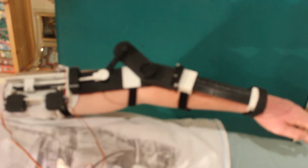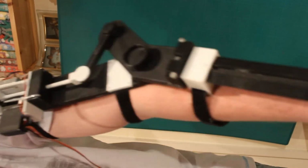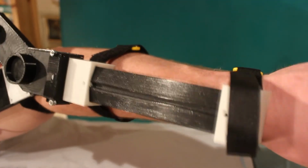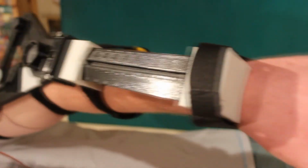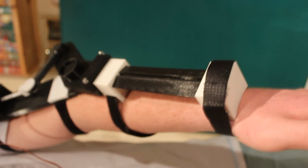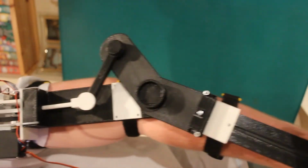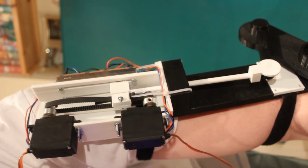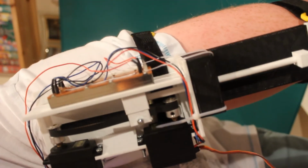I'd also like to point out the entire thing is made from 3D printed parts or electronics parts and bolts, M3 bolts. So all of it's made of PLA, so it's extremely light and really strong. So for instance, here on my arm, there's a strong shape structure there, which I've used to just hold my two blocks on. I'd like to redesign that as a more ergonomic part. But for that, with dual servo actuation, is working really well, and I'm really happy with that.